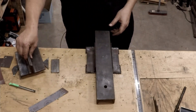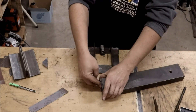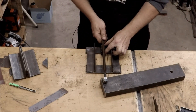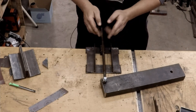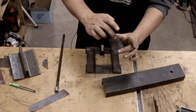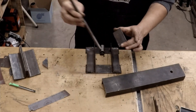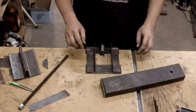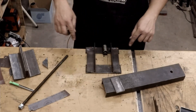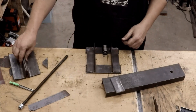The first thing I need to do is weld the edge together, then put the threaded rod through the bolts, get it nice and straight in line, and weld the bolts in place onto the frame. Before I weld the flat bar piece I'll need to drill a hole for the threaded rod at the right height so it can go through and move back and forth. Then it's drilling holes for the bolts, and we'll continue assembling the jaws and all those things.